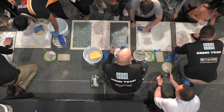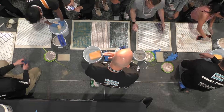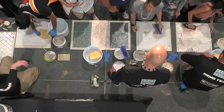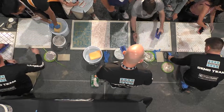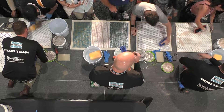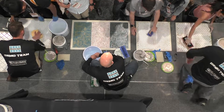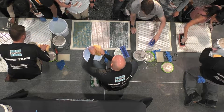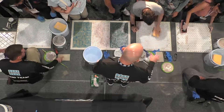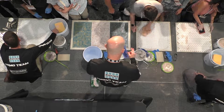So, when do you clean it? Basically, the cleaning process is: normally I do about an arm's length at a time. You do an arm's length, then you do your first pass on cleaning. Depending on the size of the joint, sometimes it'll be 45 minutes, sometimes it'll be an hour or hour and a half. The wider the joints, the longer it takes to cure. For the sponge on your first cleaning, I would hardly use any water whatsoever — just damp, nothing dripping at all. The first wash is the key because that's what's dressing the joint and keeping it nice and smooth. Then you can wait an hour and a half and hit it with the doodlebug for that second wash.